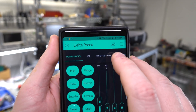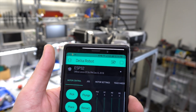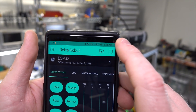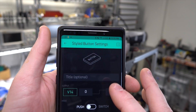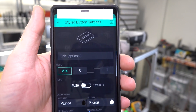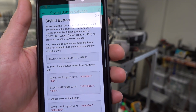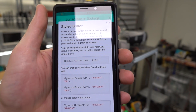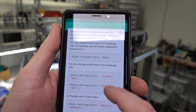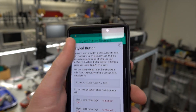It's really easy to interface with an ESP32 or any other microcontroller with Wi-Fi. You can change the colors and labels of buttons, and if you download the libraries online you'll get a lot of easy-to-follow examples. I really like that within the app itself, clicking the information button gives you example code showing how to implement it.